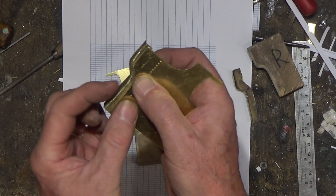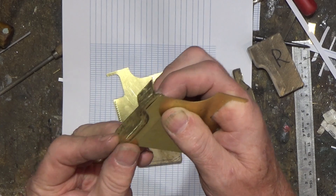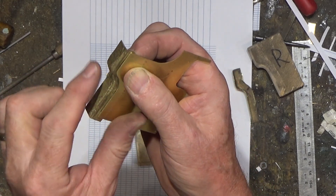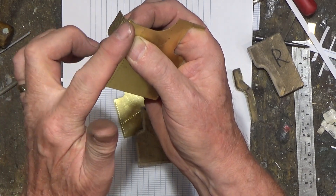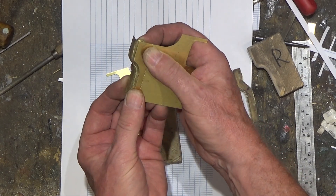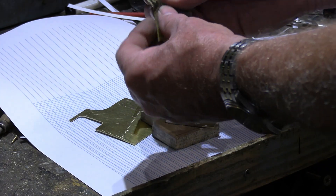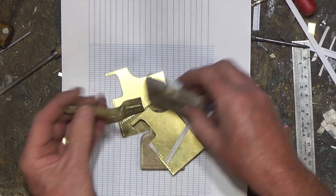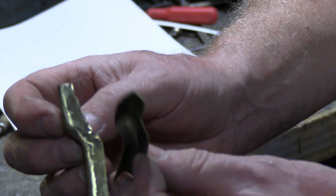At the moment there's going to be a step where the rear bunker plate fits on and you've got this curve going round. We don't want that — it has to be smooth and round. So when this is riveted on and fixed into position, I'll use filler solder to blend a smooth double curve all the way round. At the moment they might look a bit ugly and crude, but I can assure you that by the time I've finished and fitted them, you won't see the join.